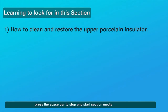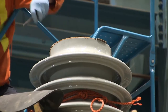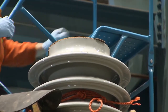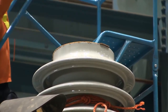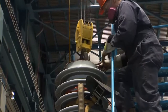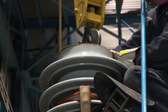Measuring and cleaning the upper porcelain insulator. After measuring and cleaning the porcelain on the bottom half of the bushing, the same procedures should be performed on the upper half. Since the upper porcelain insulator is seated upright in a service well, use a rolling warehouse ladder equipped with hand rails and with the locking mechanism activated to take measurements for replacing the gasket at the top. Using a knife, remove the compressed and expanded portion of the old gasket so that the dimension from two opposite edges can be determined. Proceed to measure the OD or outer diameter and the ID or inner diameter. After measurements are taken, use a chisel to remove all of the old gasket material that has adhered to the top rim of the porcelain.